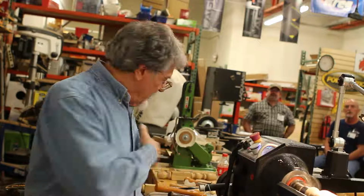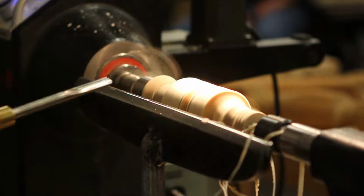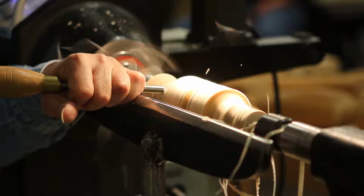So you know, in real life, when you're making a cove, you're going to make a cove between two limits. And I'm going to use a smaller gouge here just to show you. The first thing you've got to do is get some depth going. And what I've done there is I've used what's called sliding entry. When a gouge enters the wood, there are two different ways it can enter. It can be a piercing entry, which is where the edge actually pierces the wood like this, right? Or it can be a sliding entry where you're just going in like that.